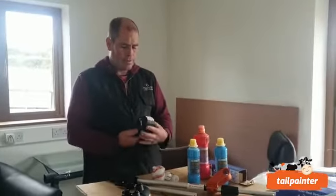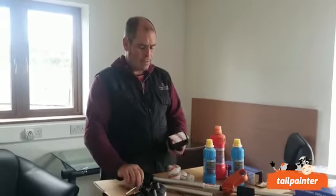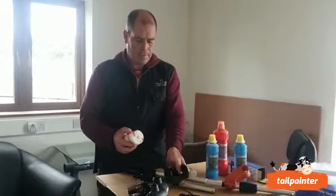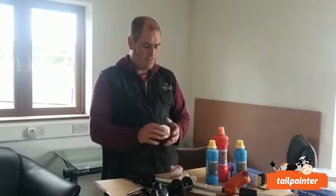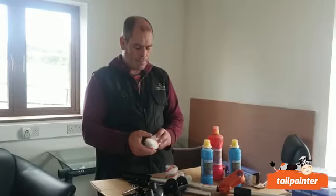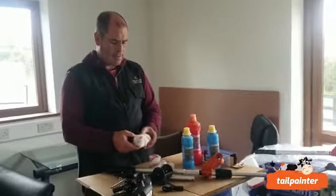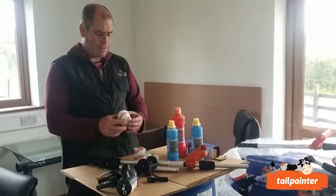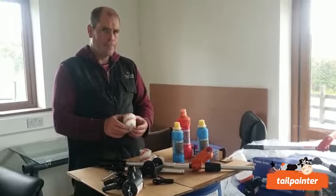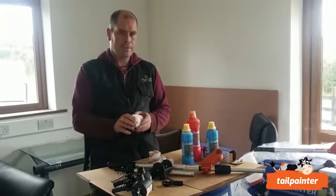The other reasons for leaking paint: one would be the nap — if the roller happens to have a tear, or some of the nap is very flat, that can cause it. The other reason is a roller that has been used an awful lot, where the nap gets flattened.